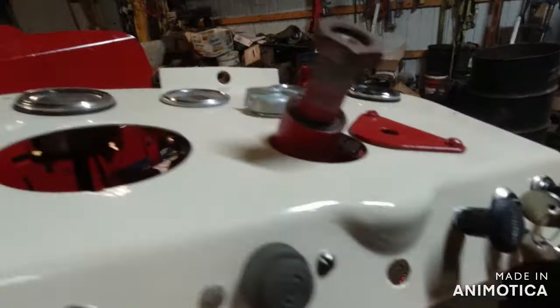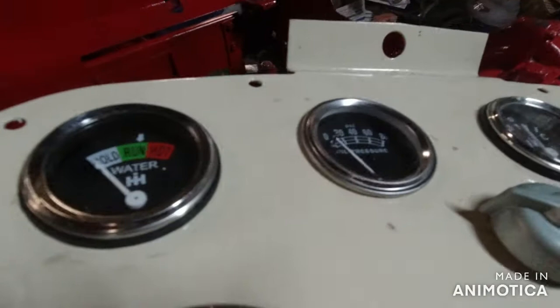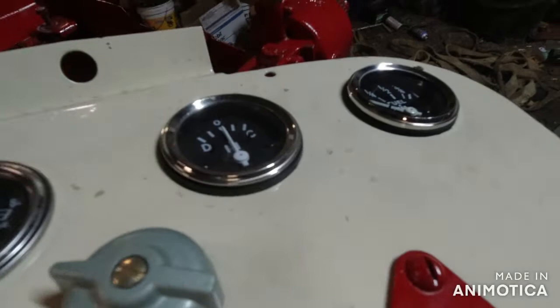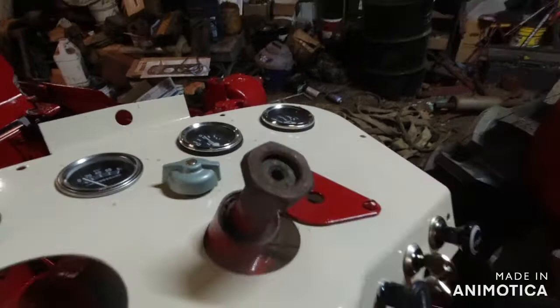But let's talk gauges now. These two gauges, your water gauge and the oil pressure gauge on this tractor here, they're mechanical. But, of course, your amp gauge, that's your voltage, so, of course, it has power running to it. And then you got your fuel gauge. Well,